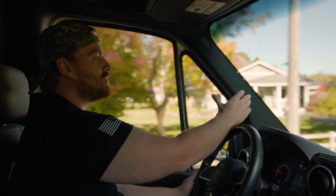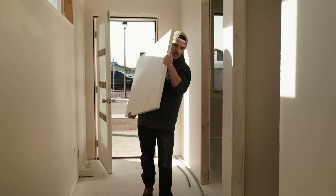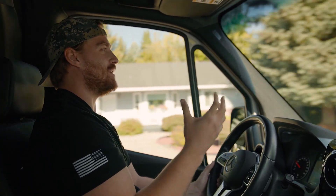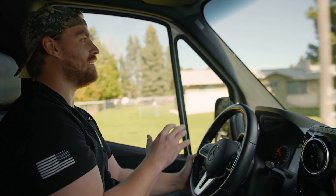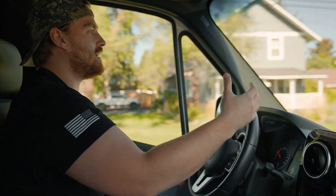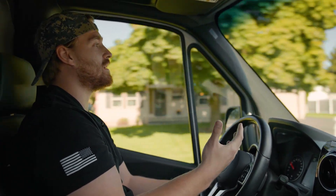Templating is so important because there's so much that can change from the original idea to when you actually bring stone in there. One of the big challenges with that is just imagining everything. You have to do it all in your head — the whole install, the whole fabrication process — and I have to make sure any potential roadblocks are found at the beginning, before they come up for the fabrication crew or the installation crew.